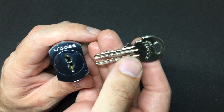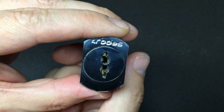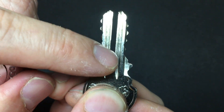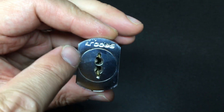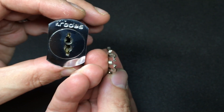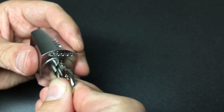Why am I so excited? It's just the unique form factor of the lock. It's dual bitted but it's got two completely separate keyways. If you look at the key, you'll see it's completely split like a fork with two tines, and it just acts as two completely separate locks — one facing up, one facing down. It's got some basic warding in but it's so cool and there's just nothing else I've seen quite like it.